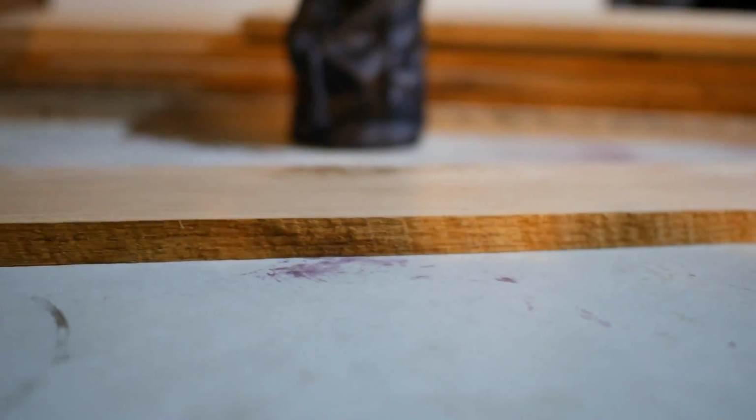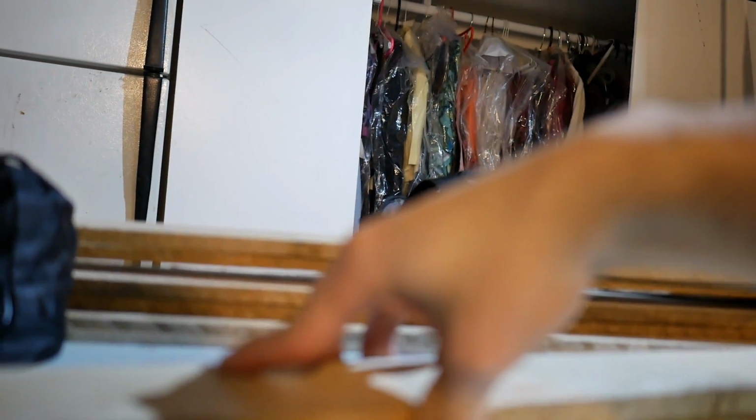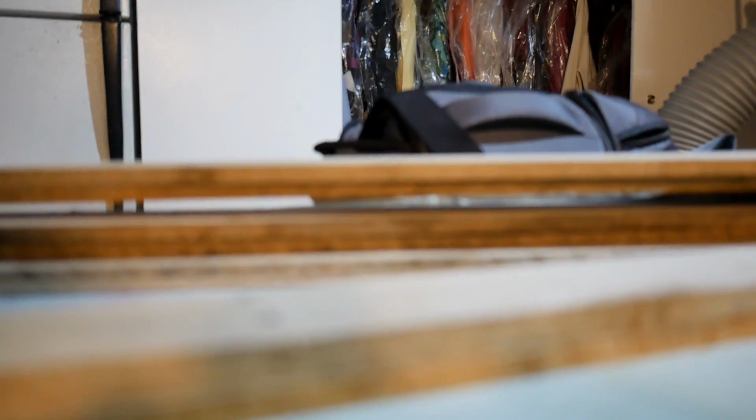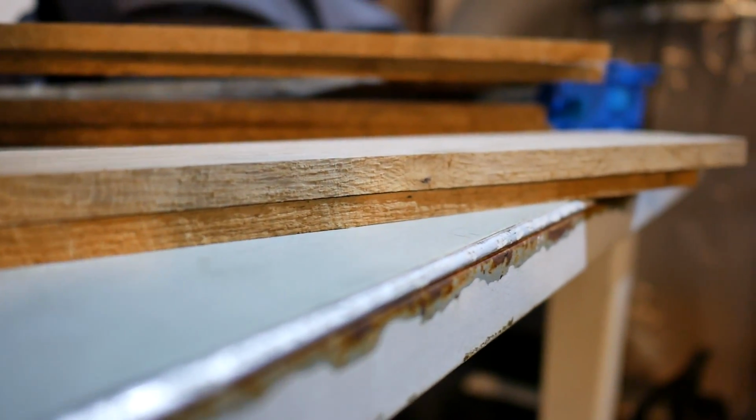My boards came out almost completely flat after being planed down, but a very close look reveals that there is still a tiny bit of curve to each board after being planed. It's less than a 1/64th of an inch on long boards, and it really doesn't bother me at all, as I can live with these results, as it's actually not that bad. I can always go in and adjust the height of the cutter head, but I'll do that when it gets worse or I need to change the blades, as it's not very noticeable out of the box.